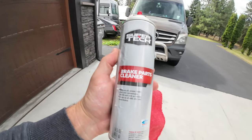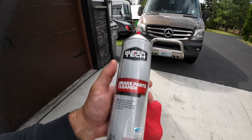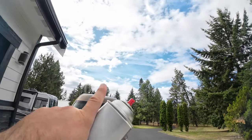So this lap sealant calls for, obviously, as any caulk or anything else you're doing, a clean surface, which I thought about using gas for. If you guys don't have this, you can use just regular gas and clean it all up, let it dry up and put on the stuff. But this works just as great. Brake cleaner. This will get rid of really anything. You spray this on, wipe it off, clean it up, let it dry up, and then we're gonna put the stuff on.